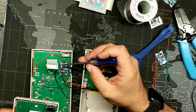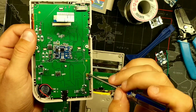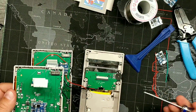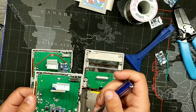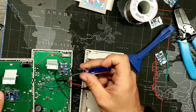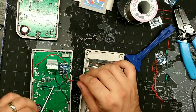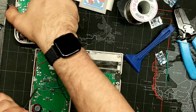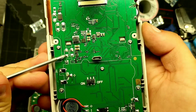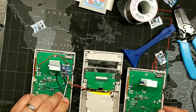For the in negative, that's a black wire led down to the gold pad. You're going to need to pre-tin that pad a little because copper doesn't bond instantly with solder — hold the iron on there and let it sit until the rosin starts flowing out, then it'll start conducting onto the pad. Run that into the in negative. Then we took a green wire and wired it to the pad on the left, which is going to be your charge pad going to the out positive on your TP4056.